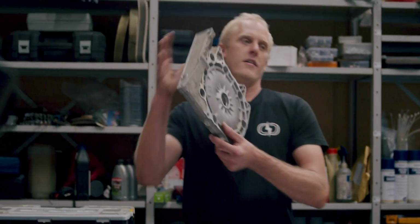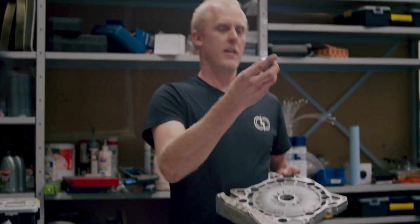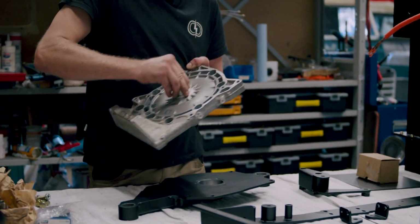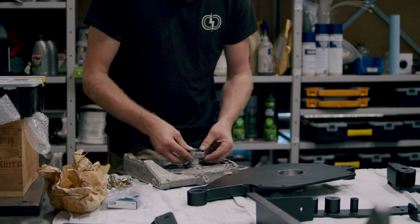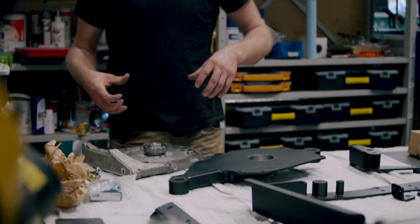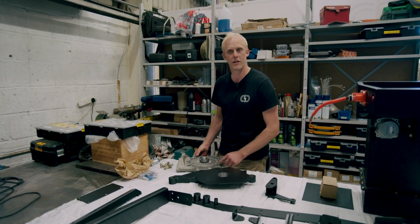So we've got an old back plate off a motor. We've turned up a little boss that goes into the seal face in the back of the motor housing. That then takes one of our bearings onto it, and then our motor plate assembles onto that, bolts onto the jig, and we center dot the 2 dowel locations.